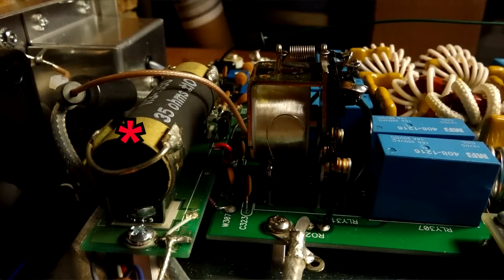The actual gain of this amplifier is 17 dB. The devices are natively that much gain, and with four MRF450s in the final, you could actually drive this thing to full output with around 10-15 watts. But what Ameritron does is put a 35-ohm resistor on the input to cut down the 100-watt output from your radio going into the amplifier. If you wanted to match this up to a KX3 or other 10-15 watt radio — or even a 5-watt radio — there are probably instructions out on the internet, but be aware that would void your warranty.